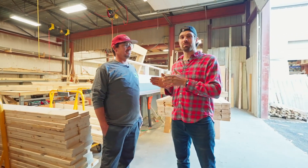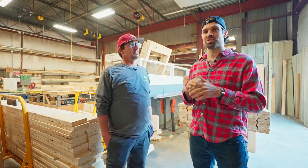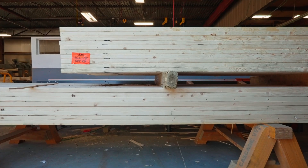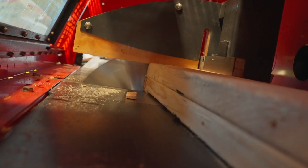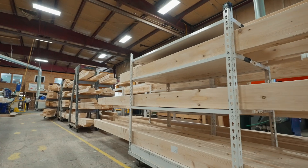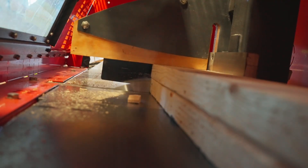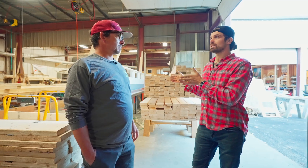We're going to build an entire panelized house structure, starting at the first step: taking a design and producing a cut list. This is all raw stock for Doug's project. This saw will optimize and cut the entire house, spitting out random parts with labels. It's not cutting in sequential order — it's optimizing each cut per piece of lumber. You're shooting for basically just a trash bin of sawdust and scrap as waste for the entire project.